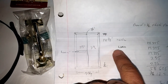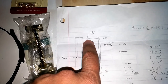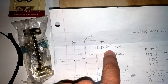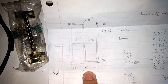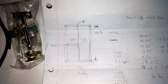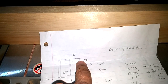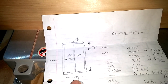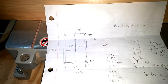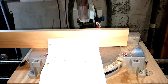This pine here will be for the outside of the box. My measurements are fourteen and three-eighths for the interior measurement, and seven and three-quarters also for the interior measurement. Let's start cutting. I want to make sure I do one side first and then the other, and whatever I do for one board I want to mimic for another so that I can do our bottom piece. Always refer back to the diagram — measure twice, cut once — especially when you only have so much board to work with.